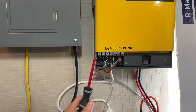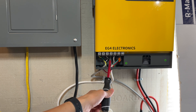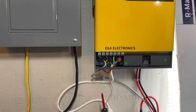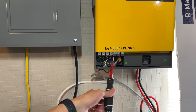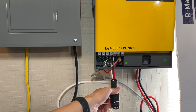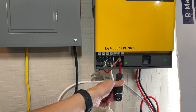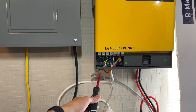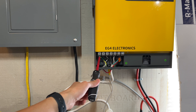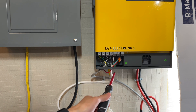Let's talk about the connections. This right here is where the AC input is — ground, hot, and neutral. I have it connected but not plugged into anything right now. I did use it as a charger before, but note that the AC input cable does not come with the unit. These two terminals here are AC output — hot, neutral, and ground. My ground is tied off to the screw on the bottom of the inverter, as the manual instructs, though the ground terminal here and that screw are electrically connected.